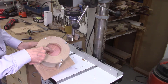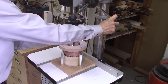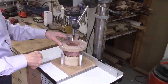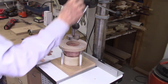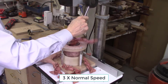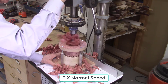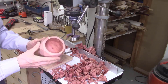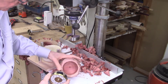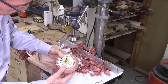This is a 3¼-inch diameter Forstner bit, and I want to drill a hole about an inch and a quarter deep. And there's our perfectly drilled hole. I can now go and insert my clock. Part two of this video series will describe the sanding and finishing of this faceted desk clock.